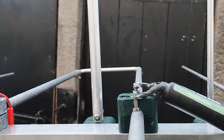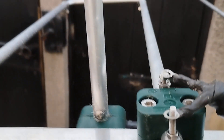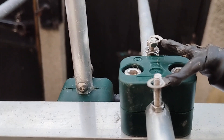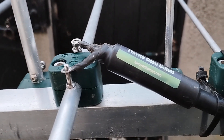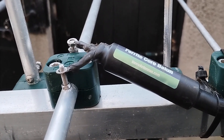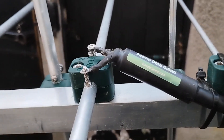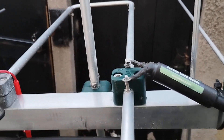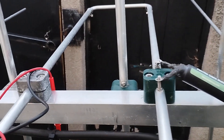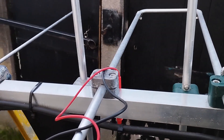A simple bad connection can cause you a few issues. I'm hoping that now I've got that cleaned up a little bit, I'll be able to tighten it up and everything should be good to go again. That's the situation on the inner antenna connection point on the loop fed array — a little bit of corrosion probably causing me the issue. You can see there's a little bit appearing here and there.